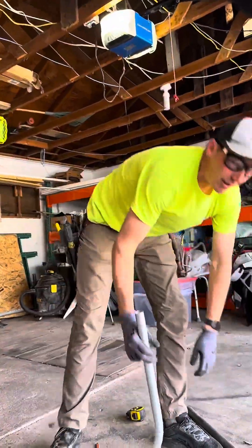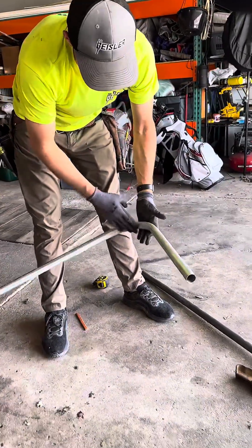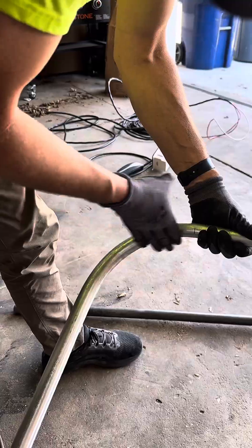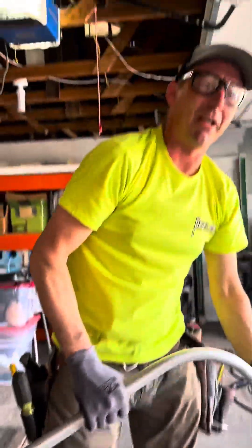Now if you don't keep enough foot pressure, you'll end up with a lot of wrinkles here. Another way to end up with wrinkles is it's hot out and that sun's beating on this conduit, so it's swelled. Sometimes if you just put some WD-40 or something on there, it'll let that bender slip. But this is for a friend of mine — it'll be fine.